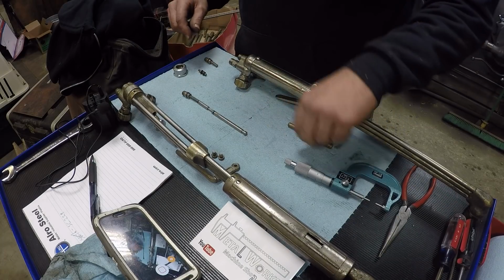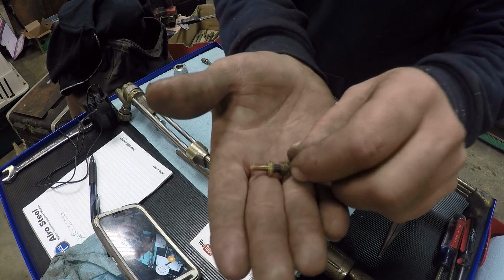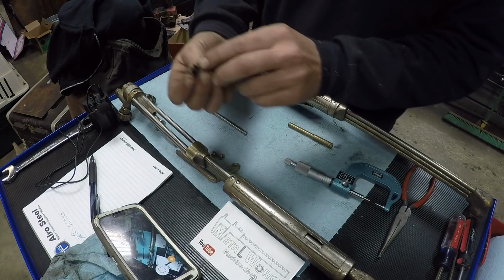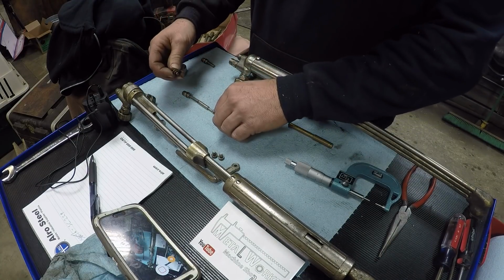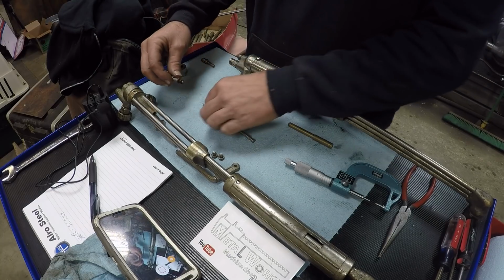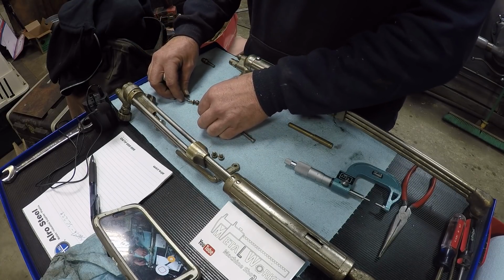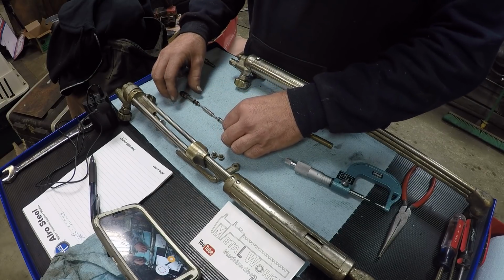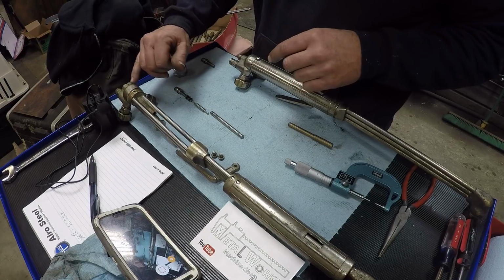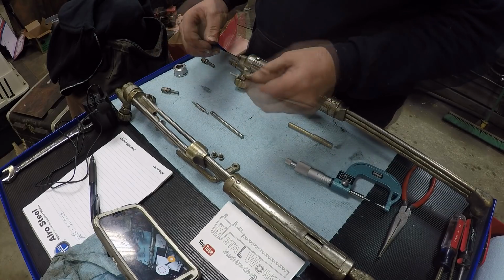I took this one apart, found this little piece of brass. And that would go in between the spring sets on that, and that pushes that needle valve open, and in return it just pushes it down to release the air up through inside of here to shoot it out down to the tip. So this is what I got. So I'm gonna try to make this.